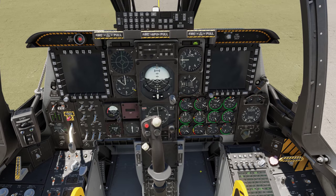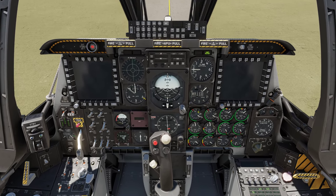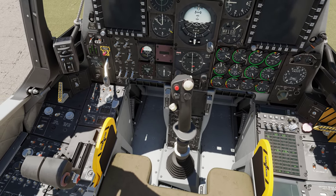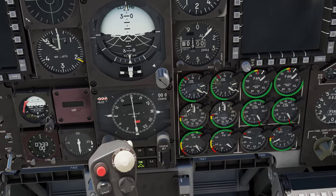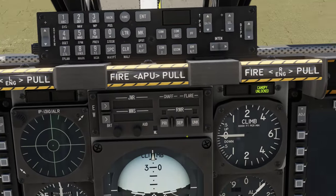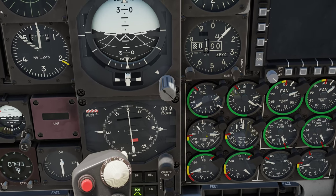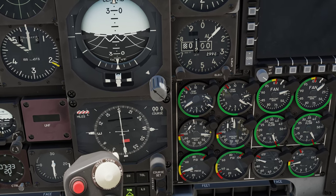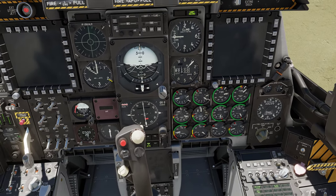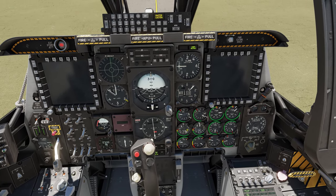After that, it's time to get our left-hand engine pulling up. This is the stack of gauges for the left-hand engine. We're going to move the left-hand throttle forward off the detent. Watch your gauges — you're going to see everything start to move. What we want to look for is the core RPM percentage coming past the 30% mark. If it smoothly moves past it and continues to climb, you're going to have a good start. If it slows down and hangs up around 30%, you most likely have a problem.